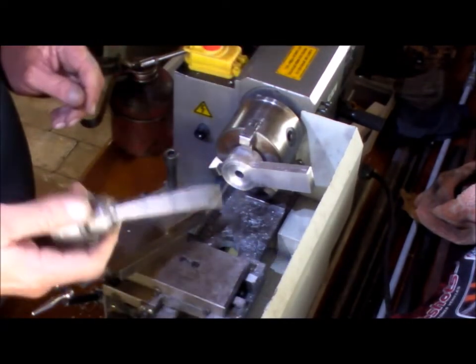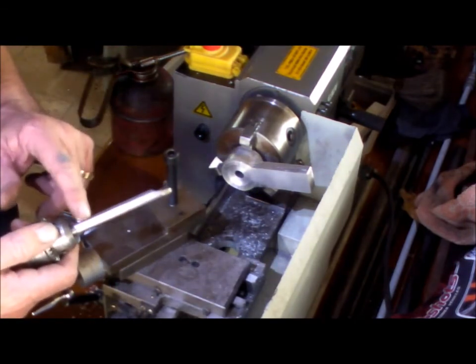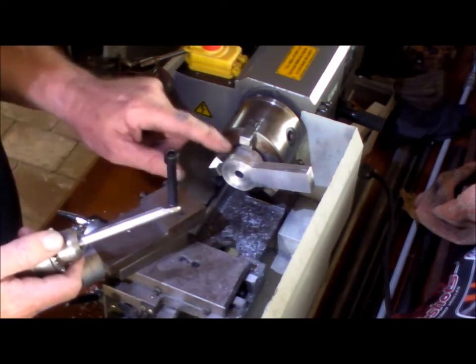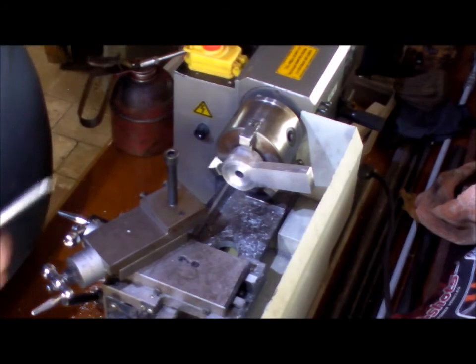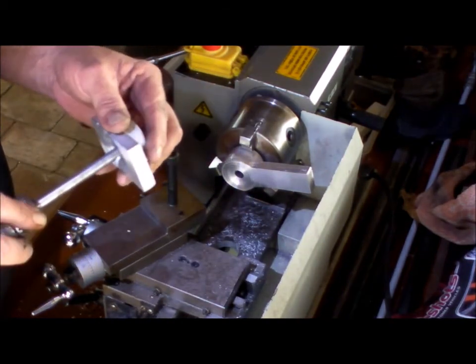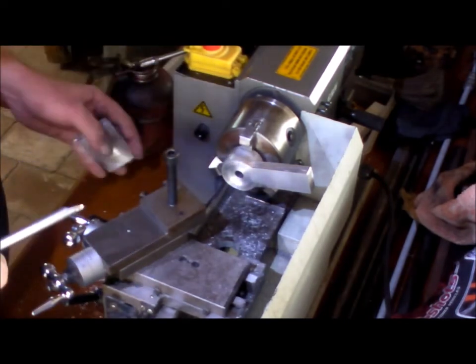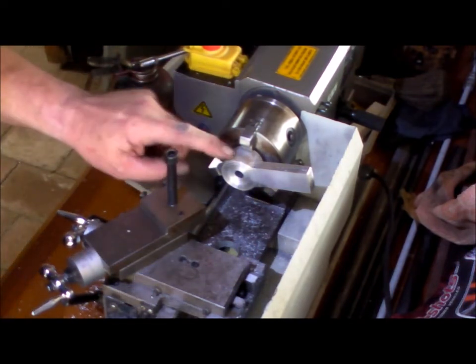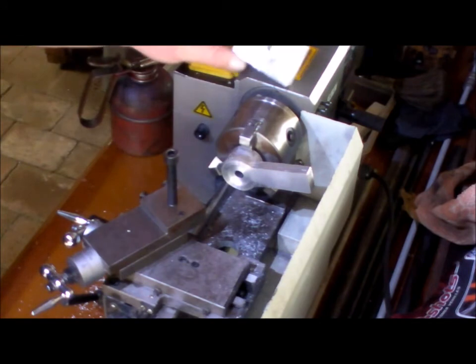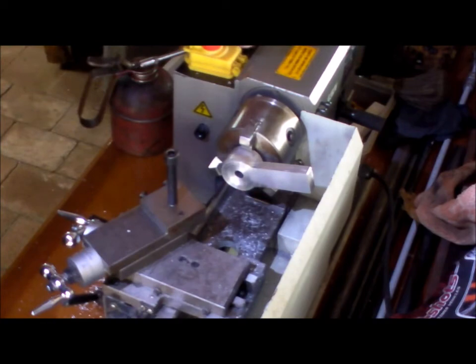Anyway, that's a nice close fit in there, which is good, because this is the material I'm going to use — super-glue it into the hub. So this one has to be machined out also. I'll catch you later after I clean these up, bore this other one out, and get it set up to clean up the faces.